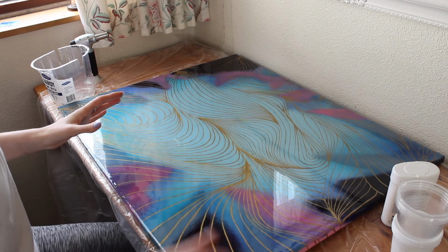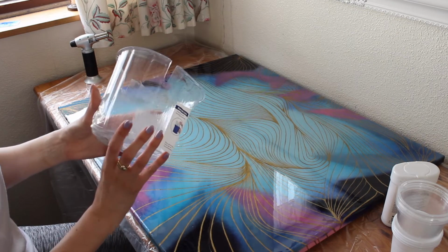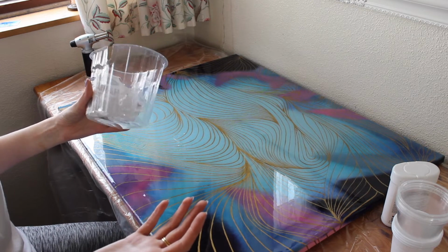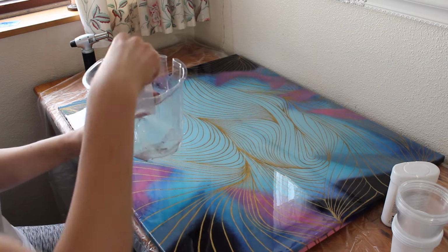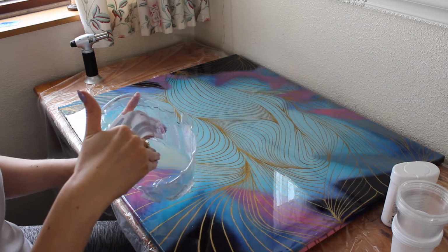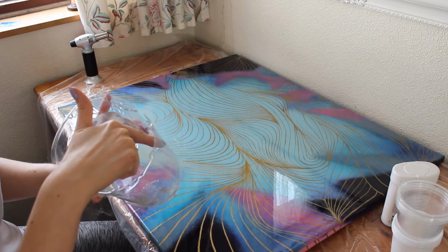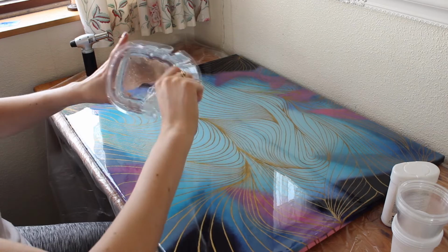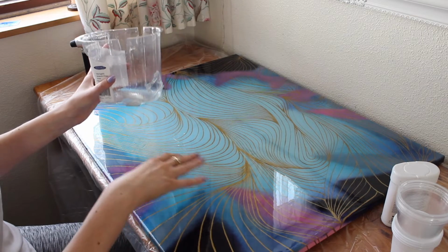What I think happened is that I mixed the resin together in one of these buckets here. I've been looking up lots of forums and seeing why sticky resin occurs, and the problem most people make is that when they're mixing, they don't scrape the sides, they just mix in the middle. Therefore the resin in the middle is correctly mixed, but there's unmixed resin on the outside, tending to be more resin than hardener. So when you use your stick to scrape bits out and put it on the piece, you're getting unmixed resin, so that's why you can get wet spots.